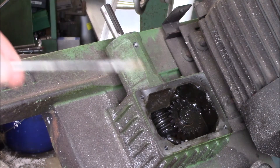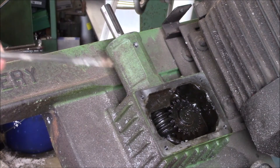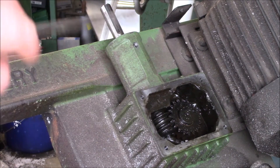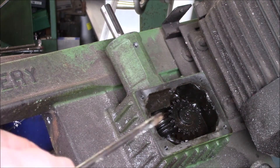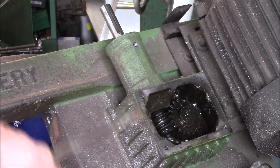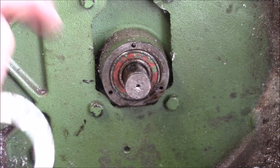Looking at the parts diagram, the way this is set up there's a bearing at the top, a bearing at the bottom, and a spacer in the middle with a groove around it — I think that's what the set screw goes into, to hold that spacer inside the casting. There's the round gear and then there's the spiral one; both are pressed in. What you have to do is press out the one with the round gear from behind. The worm gear — the spiral gear — is machined as part of that shaft, and then the two bearings and the sleeve are pressed onto the shaft.